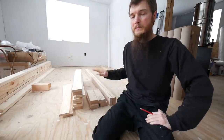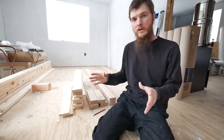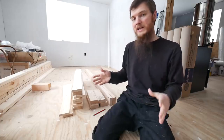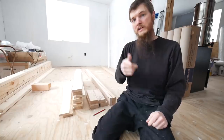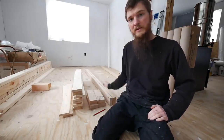I got all my wood cut and I had to make some decisions here. First I had to look up the size of a twin bed. I found that they range from 38x74 to 39x75 inches. I chose a 38x74 based on some of the measurements we had in our own house on our own bed frames. I cut my two side rails to 74 inches long.